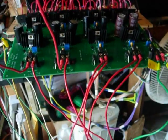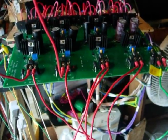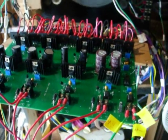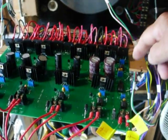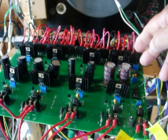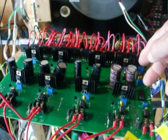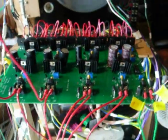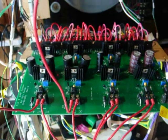And I don't know what happens when I parallel up all these DCs going back into that battery. But that's the basic idea. And I think I've got the two NE555 timers. One is producing 1 pulse to dump, and then about 8 or 9 pulses to fill the caps. And so that seems to be all working.